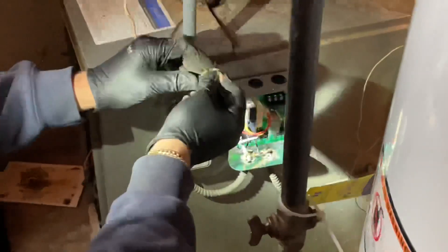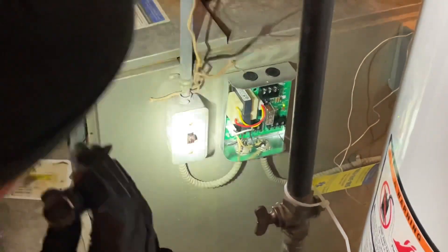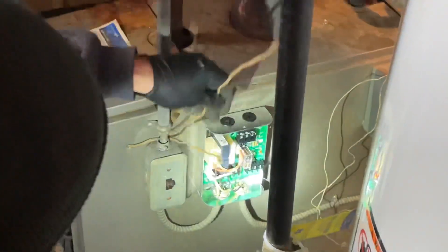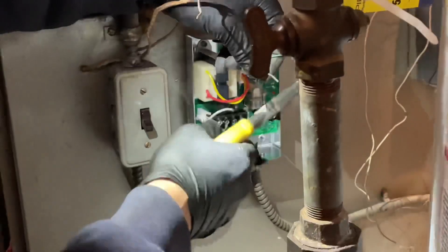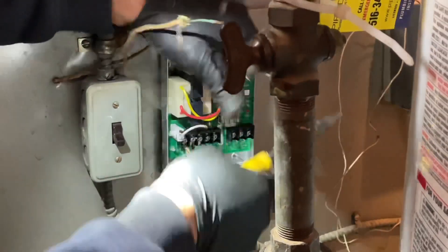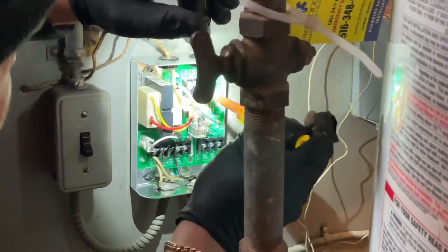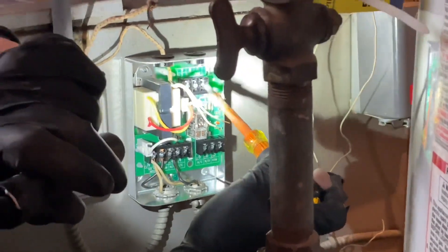Now I've got to figure out which one is the thermostat. It's not going to be this one — this is boiler control, which is XX. This is TT, because it goes up the conduit. If you wanted a Nest thermostat or a Wi-Fi thermostat, you need that common. It's on most new relays now, but you need that third wire.